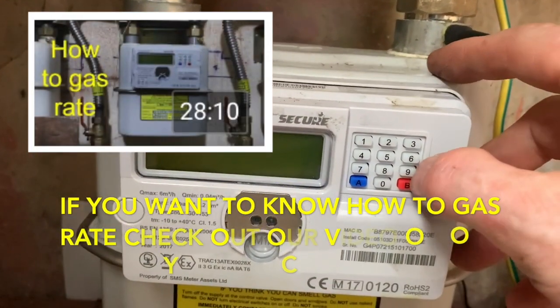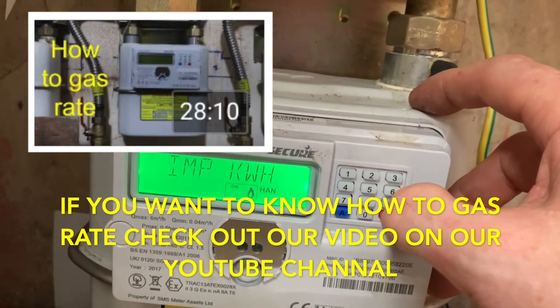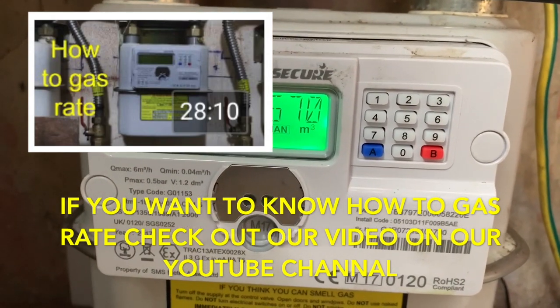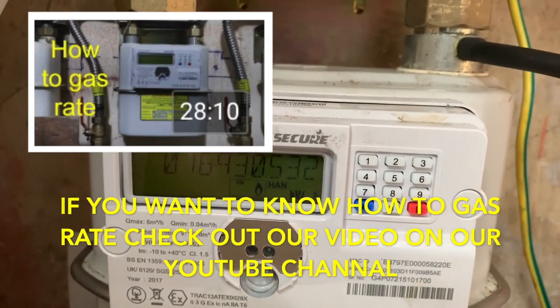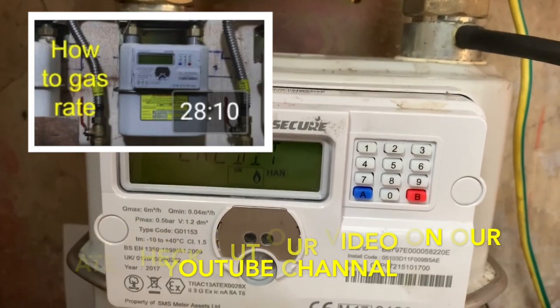If we need to gas rate this fire, are you ready, Mo? Yeah. So 1, 2, go. It'll come up test volume. We've got 0.557. So we need the 0.557. So that's our first reading. We're now going to wait 2 minutes and then take our second reading.